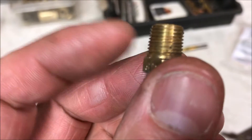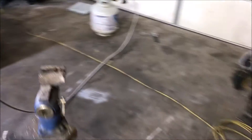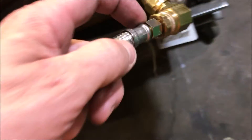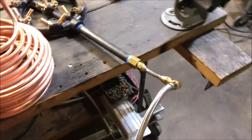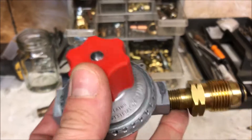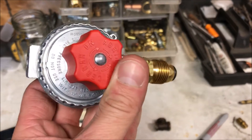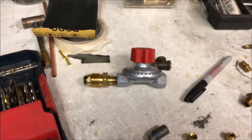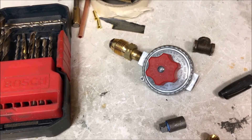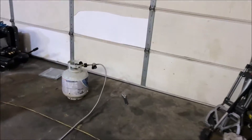Those will then fit right to a standard pipe thread. The reason I do that is you can't get these eighth-inch NPT fittings to connect to these quarter-inch connectors — they're not compatible. There are two types of propane regulators, so if you're doing anything high-flow they say to get this one, but for twenty dollars that's kind of a rip-off. If you have any input on what's going on other than lawsuits and insurance regulations, let me know.